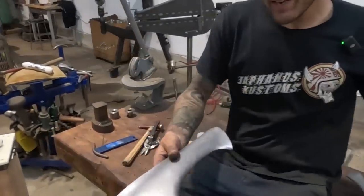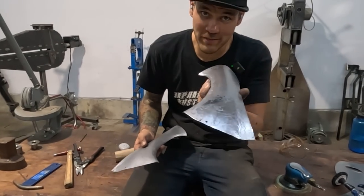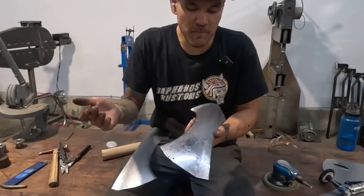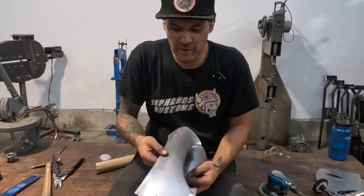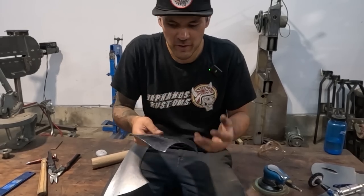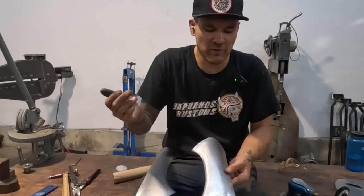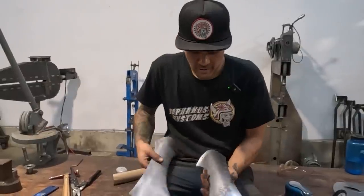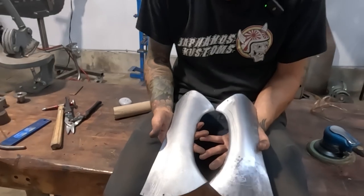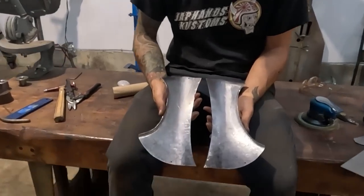Okay, well, I suppose the nice thing about using the power tools is it saves you a little bit of time. It's probably twice as fast as doing it this way, but you touch the metal a little bit less. This had to look worse to look this good. This never really ended up getting a bunch of rough texture put into the sheet metal. You basically have enough power to just stretch and smooth it that way. But in the end, we got the same exact result. I think the pieces are damn near identical. The backsides look identical, basically.